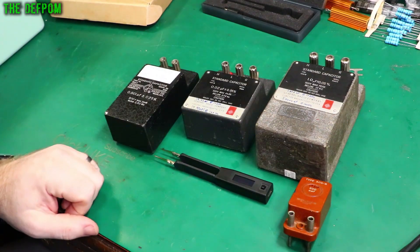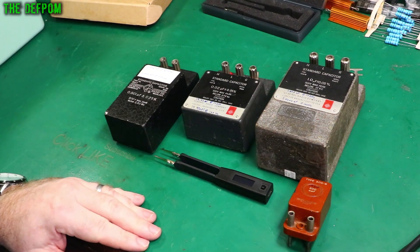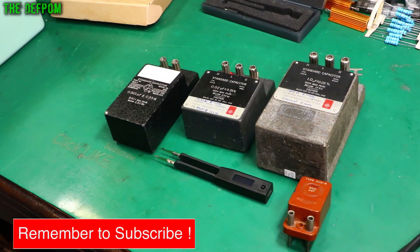Capacitance is looking really good, but resistance is potentially limited. The specifications state resistors are 0.1% accuracy, capacitors 0.3%, and inductors 0.3% also. The measurement range for resistance is supposed to cover 0.05 ohms — that's 50 milliohms — up to 9.9 megohm. But as you saw, 1 megohm is already struggling. I'm not quite sure why there's a difference between what they state it can do versus what I'm finding. Maybe I've got too much electrical noise here, which is hindering the measurement since high resistance measurements do require a very low noise environment.